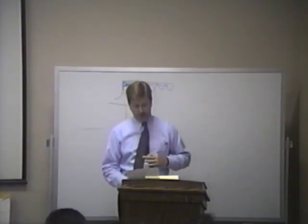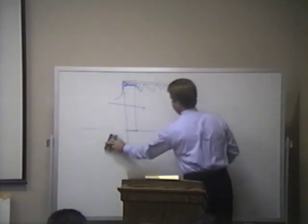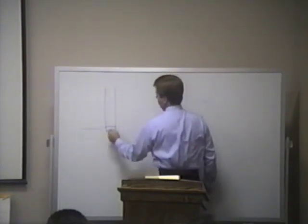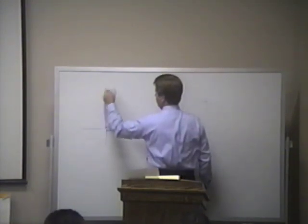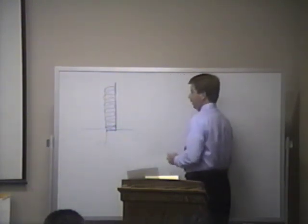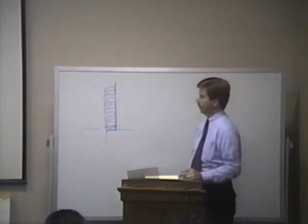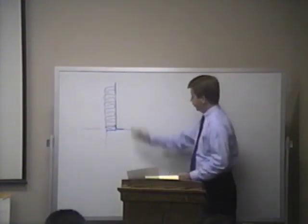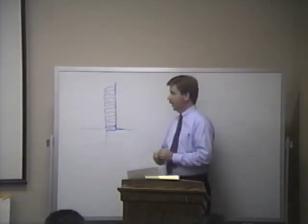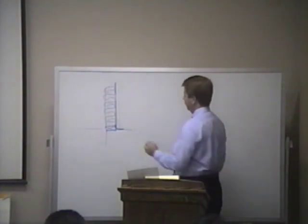One of the biggest things to do about that is tremendous, and we've started doing this on commercial buildings, what Pete mentioned on a house, is where your studs and your slabs and insulation come in, at this point put Visqueen, 6 mil, 4 mil, but I like 6 mil, it's thicker, and you wrap the entire inside before you put up any of your finished material, drywall or otherwise. You overlap your seams and duct tape them, wrap them down on the floor, and then when you put your drywall on, you can cut it back, and you go around your conduit boxes, your electrical on the perimeter, everything. And what that does is put a monolithic material in that wind does not penetrate. And it helps cut down on infiltration that is pushed through the building.